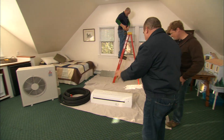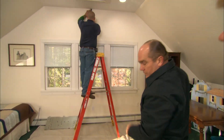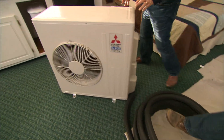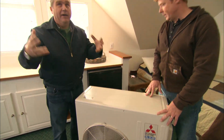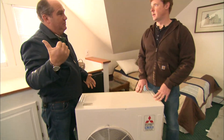We're going with a split-type air conditioner. This indoor unit will mount right on the outside wall and connect to an outdoor condenser unit using refrigerant line sets. In cooling mode, it finds heat inside the building, brings it into the unit, has it travel through the refrigerant, and dumps it outside — leaving cooling inside the building. They're used all over the planet.